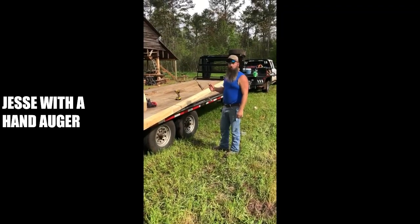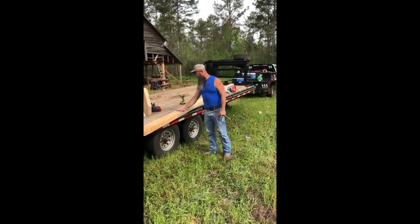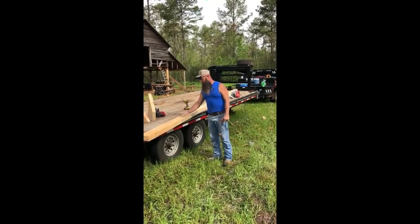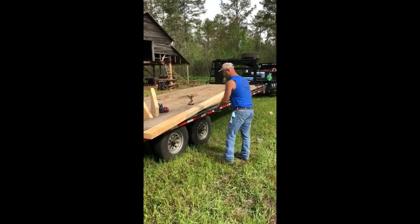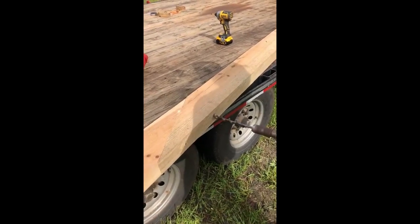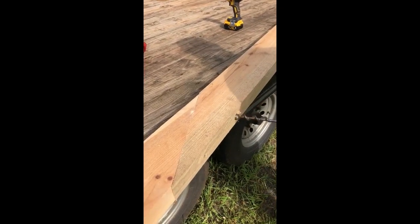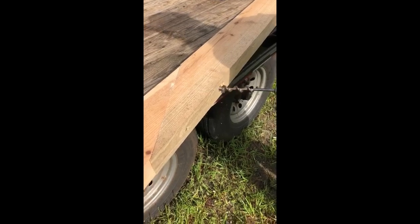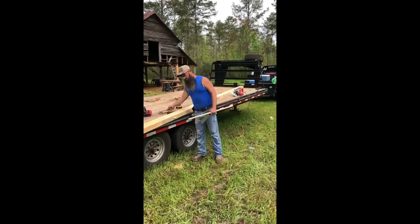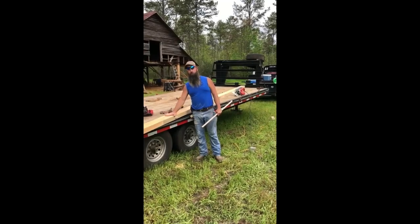Here at Old South Barns we use a lot of old equipment. This is called a brace-and-bit. We just had to join two timbers together, and we're going to make those timbers solid by putting in pegs. I'll show you how we auger a hole with a brace-and-bit — using hand power instead of a drill, coming in at an angle. Now that I've finished augering the hole with a 15/16 bit, I drive a one-inch diameter dowel into this scarf joint, and that's what's going to hold this scarf joint for life.